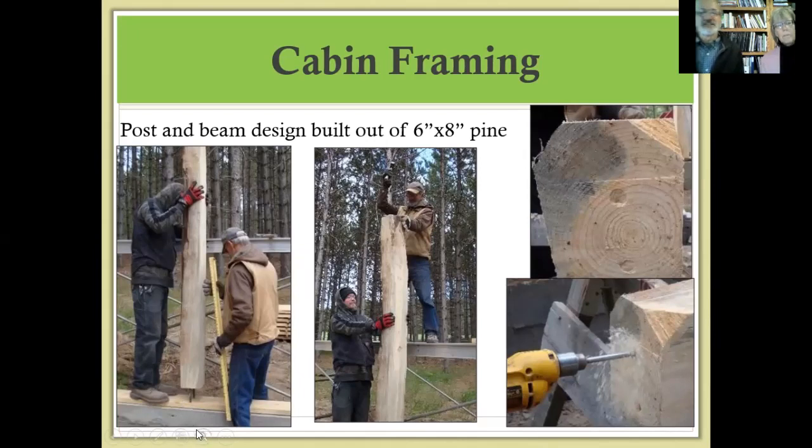They were seated about 2 feet down in the foundation and stuck up about 3 inches. These are used to seat the posts, and so we took the posts and set them on top of the pins and whacked them with a hammer to give the impression of the pins on the bottom of the post, and then drilled the holes and then set them back down to seat them in place.